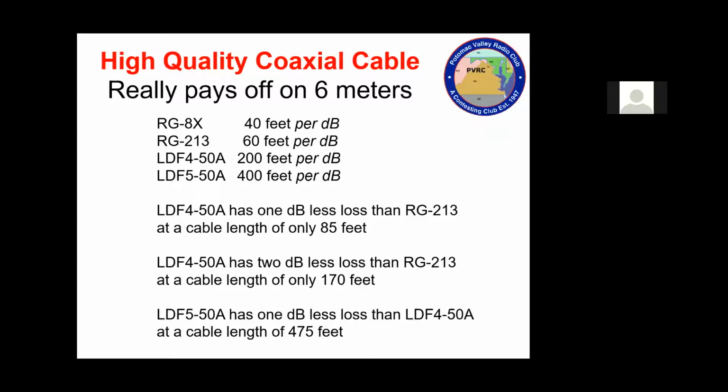One very classic one, and I see it all the time with people handling coax cables, is if their cable is kind of tangled on the ground and they start just pulling the end of the cable like they're trying to undo a knotted piece of rope. But what always happens there is that this soft jacket of the coax cable is rubbing over the jacket of another turn of that tangled mess, and you wind up creating a divot in the jacket of the cable. You've really got to be careful with these, whether it's LMR 400 or RG213, in the handling of that cable. I will guarantee you that if a minor defect has developed in that cable before you install it, water running down that cable is going to find its way into that coax. And on 6 meters, the loss is going to go up rapidly as soon as water gets in.